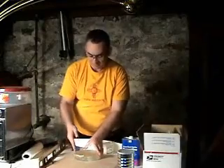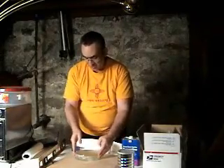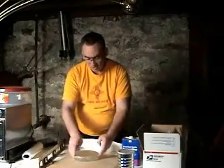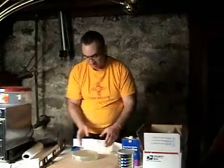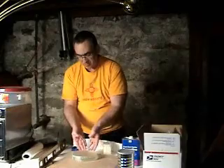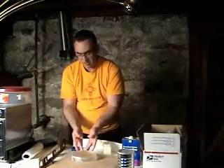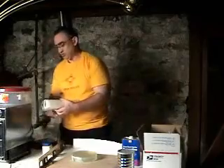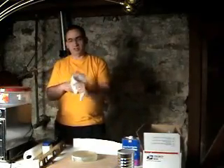Get a little around the edges. Now you're going to say, is that going to leave a pattern on the top of the dental stone when I pour it? And the answer is yes it will, absolutely. However, once you pour the dental stone you will be able to sand it down and you'll be okay — you really won't have a problem with that. I will be able to clean it off completely from the tool. So the first step is to put petroleum jelly all over my Pyrex blank. Fortunately I have some paper towels to clean the petroleum jelly off my fingers — water really doesn't do too much for it, it's not soluble in water.